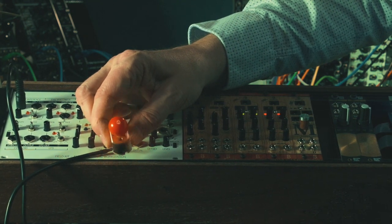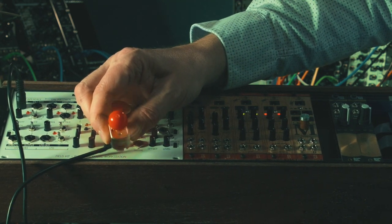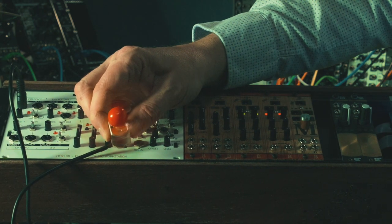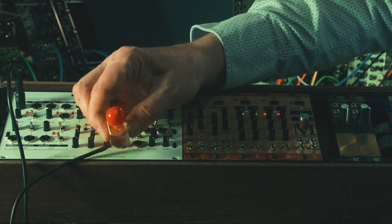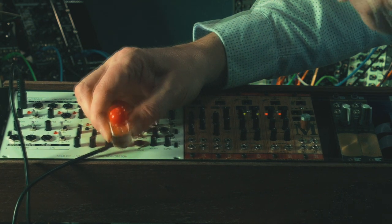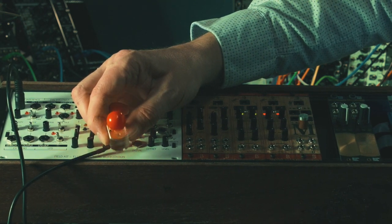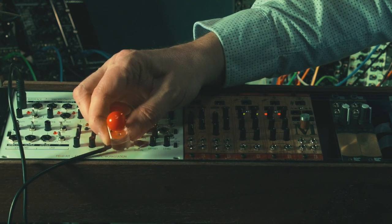It's a pretty easy operation. All you have to do once you obtain the faceplate is go in, take off those 17 nuts, remove the four screws holding the circuit board to the wooden case, then flip it over, attach your power cable correctly making sure you note where the red stripe should be on that jack, then take the red cover and put it to the top such that the bottom pin is exposed. Then you will be ready to go with Eurorack power for all your electroacoustic experiments.